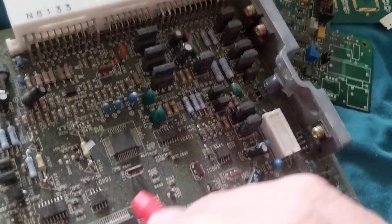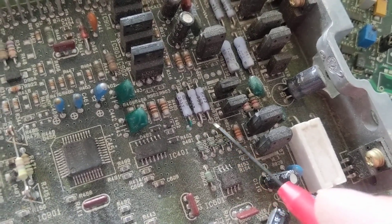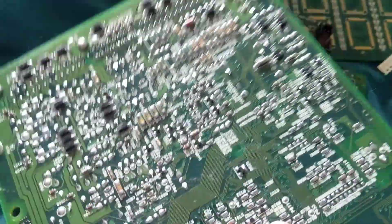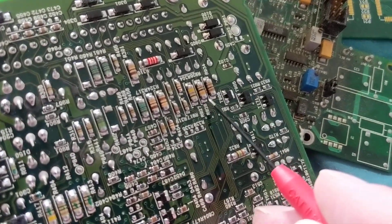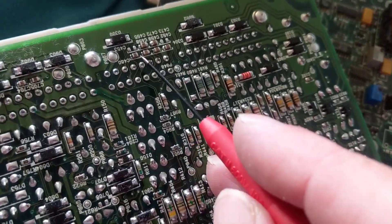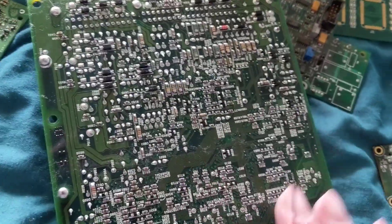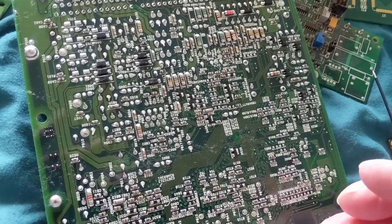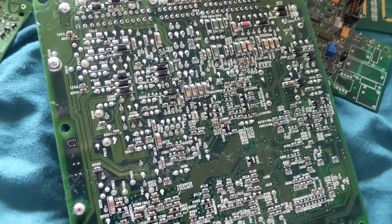So you have components on one side — these are through-holes, see the little holes that go into the pads — and surface mount, so it's like a hybrid. On the other side you also have components. You can see more resistors, diodes. We do this to compress the space as much as we can; we want to make the board as small as possible for consumer and other electronics.